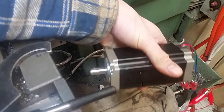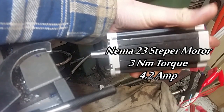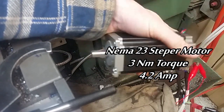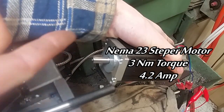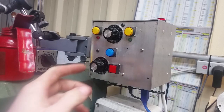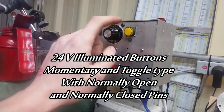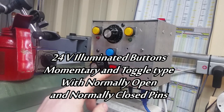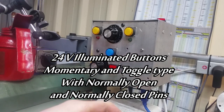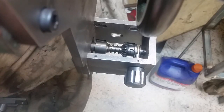From the electronics video I've got a few questions. What sort of motor is this? This is a 3Nm stepper motor and I think it draws 4A. We'll see how it goes. Some other components I used in the last video: these are all illuminated buttons. Some of these are toggle buttons and others are momentary tactile buttons. These are all rated for 24V but they work absolutely fine at low voltages. The other question I keep getting: what's the clutch arrangement? That's for the next video.